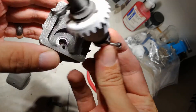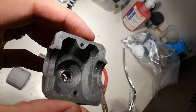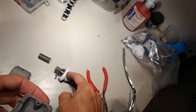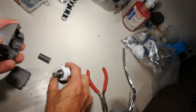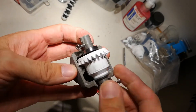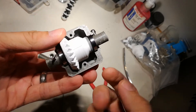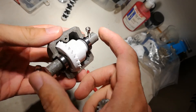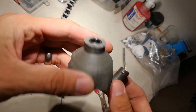See, the screws just clear it — that looks rather good. But now this thing is obviously big. I can make it smaller; I can trim this gear down just a little bit. This whole thing doesn't need to be this size — it only actually needs to clear the ring gear in one place over here. So I could make it much smaller, but let's just start with something simple and check that it actually works, otherwise I get stuck in infinite design revisions and never actually make anything.